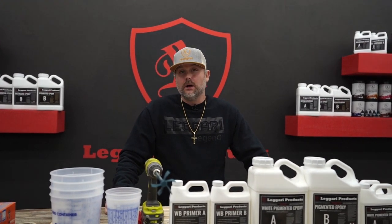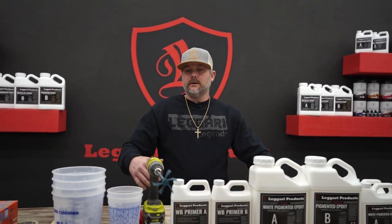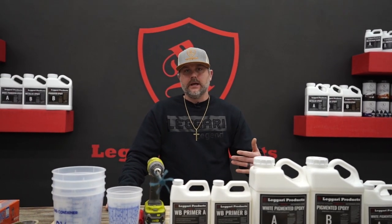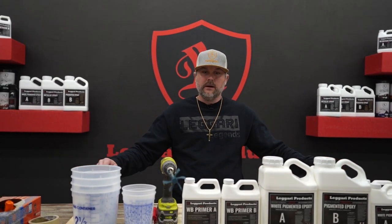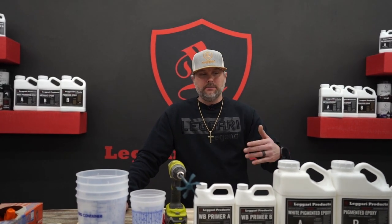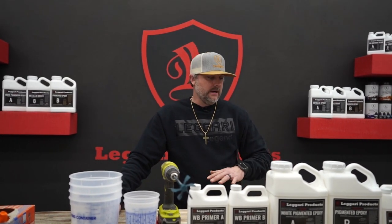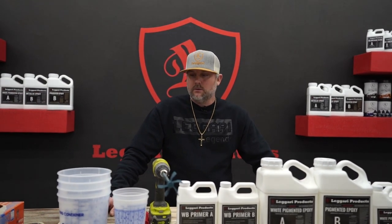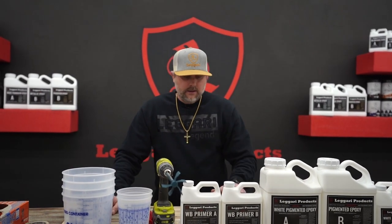If you guys are new to the resin industry, you're not familiar with our products, don't let it sit in the bucket. Get your table as level as you can. Dump it out. Your edges will just be a little bit thicker. But this way, we're gonna be able to get a nice even coat everywhere by manipulating it, letting it set up. It's not gonna flow out as much. It's not gonna move as much when it's on the board. So we'll go over that when we get there.